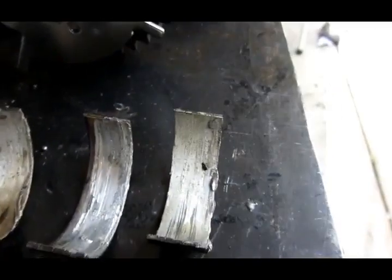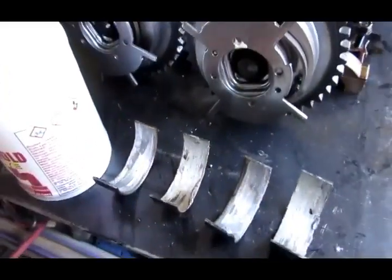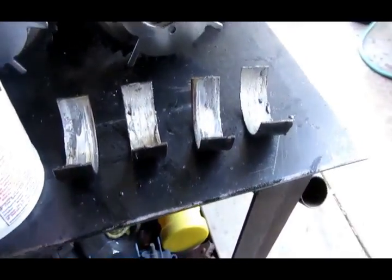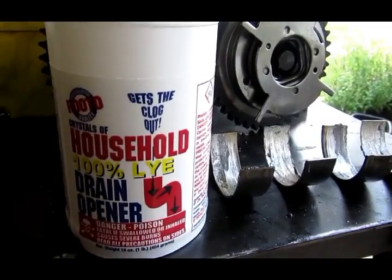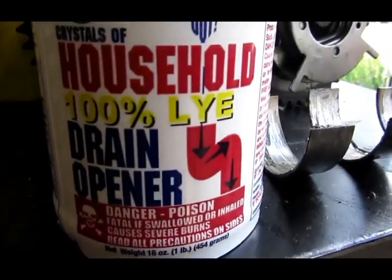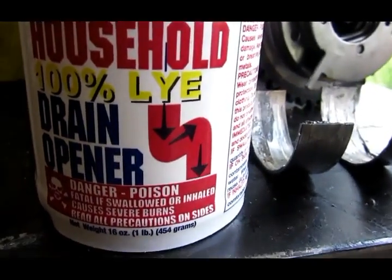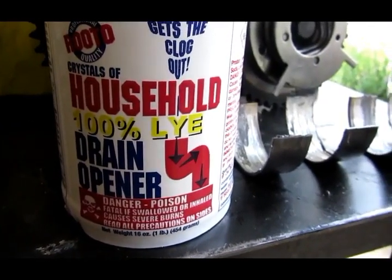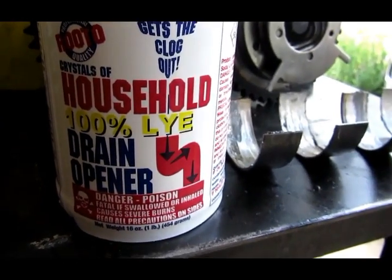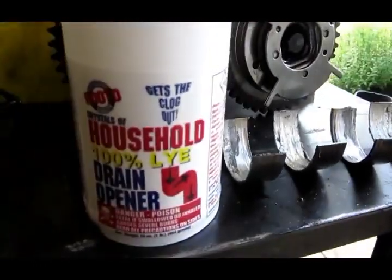Here's the thing - it's aluminum. Aluminum is usually not going to actually damage the crank if you can get it back off and repolish it. If we can put this thing back together, we're going to try to get the aluminum off the crank. This stuff is called Lye, L-Y-E - it's 100% lye, a household drain opener. They use it for cleaning drains and it eats aluminum. It's all over YouTube, a lot of the tractor guys use this stuff to clean their cranks when they spin a bearing, and then they repolish them.